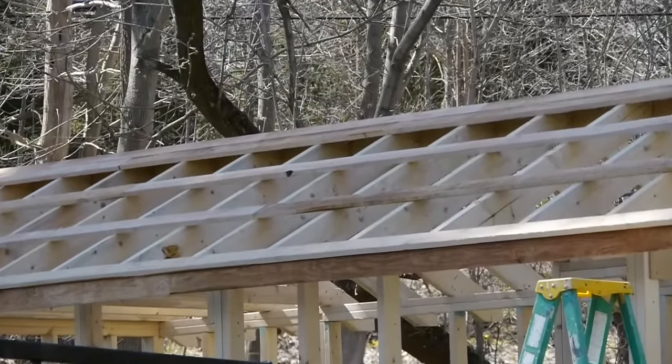The following day I got to work on the little porch area — I wanted a small outside screen porch so when I'm up in the woods and it's buggy I can sit in there. It's about four feet square, room for one chair. Here we're cutting out for the window in the porch area and I'll make a little frame to install the screen. The building is pretty square, which helps a lot when putting up large four-by-eight sheet panels — when you come to the corner it's nice when it comes out right.